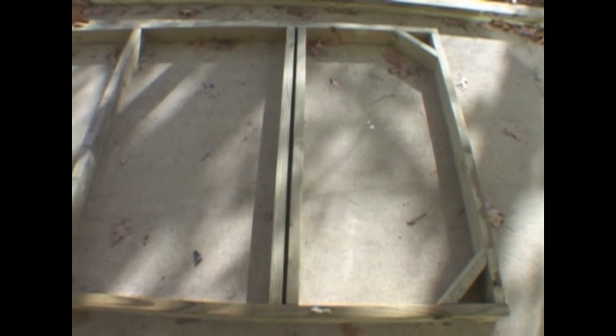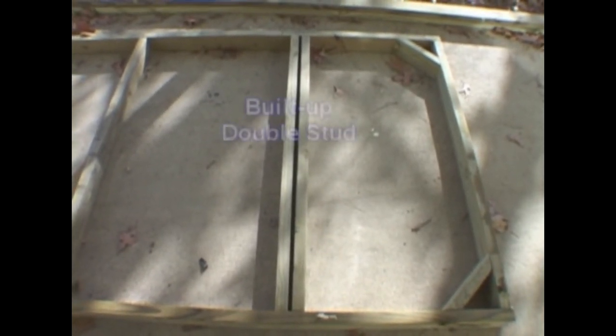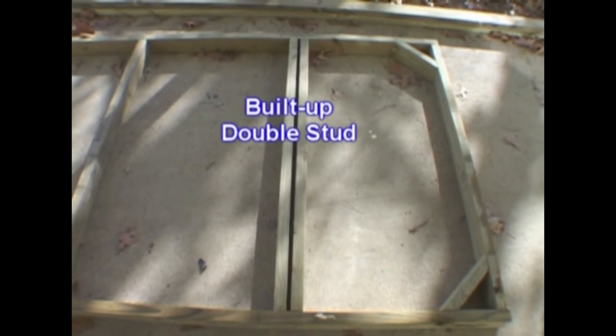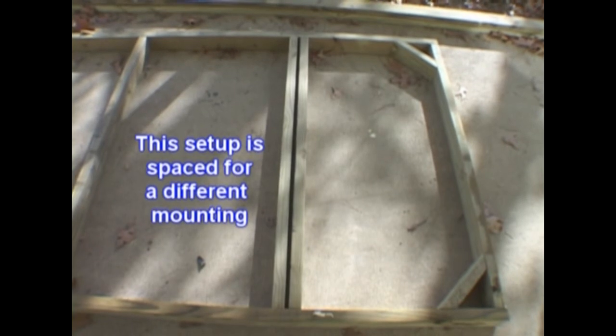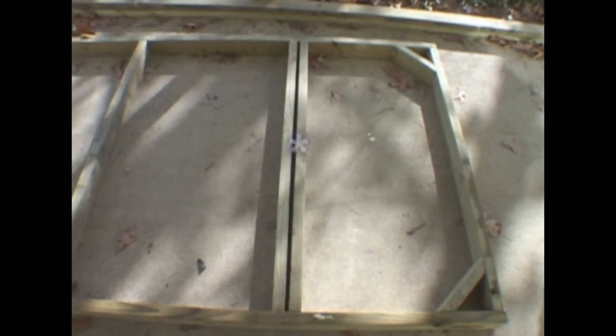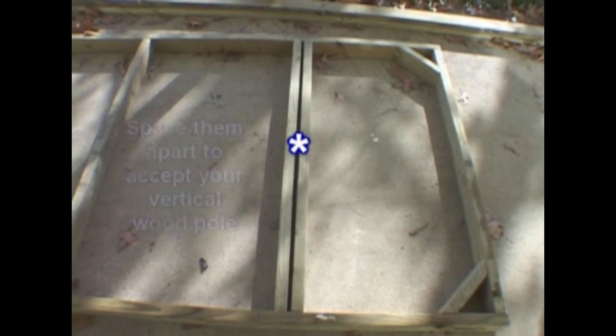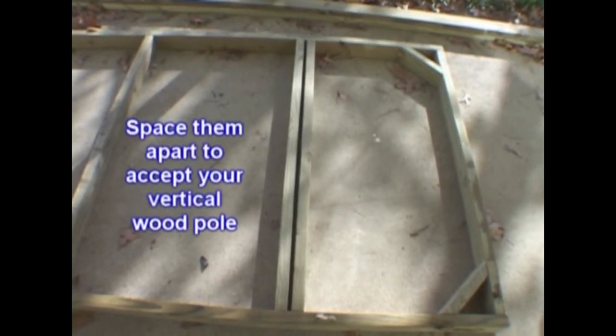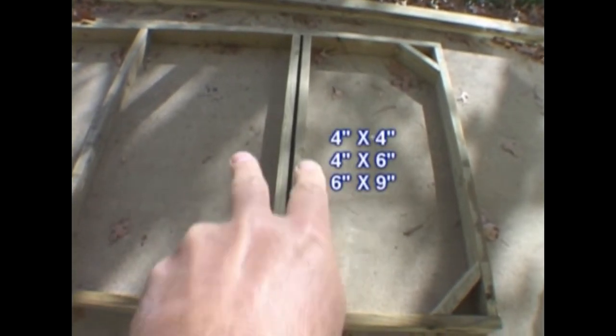Notice that on the left and right of this panel there are built-ups — multiple two-by-fours that are going to accept the vertical poles. In this case it was the extended version where we use two-by-fours on the sides of the tops of the poles. Your space between these two two-by-fours needs to be perfectly spaced for the outer dimensions of the vertical wooden pole you're going to use, so that the axle can go right through there.